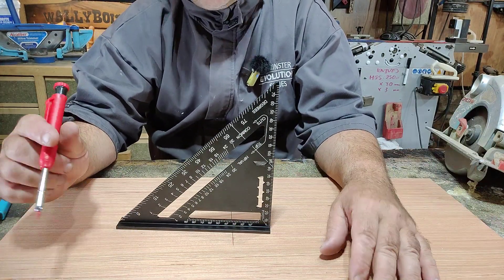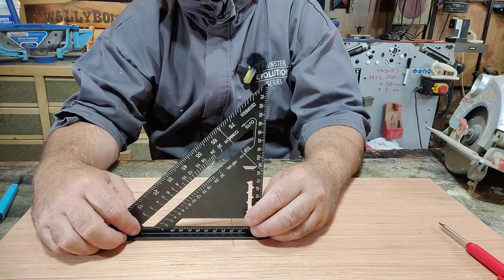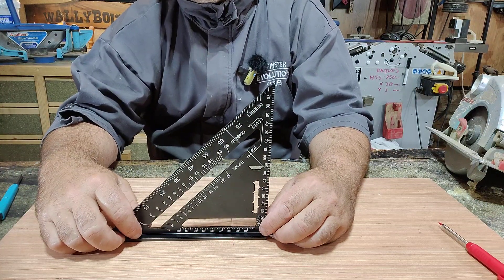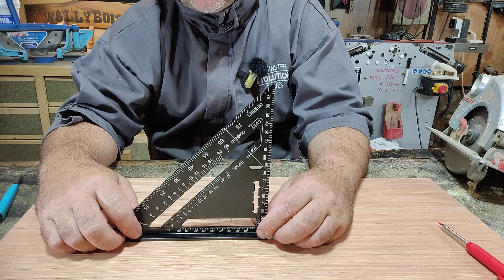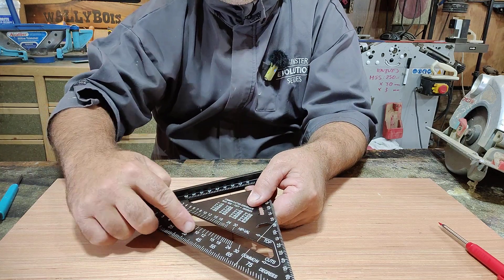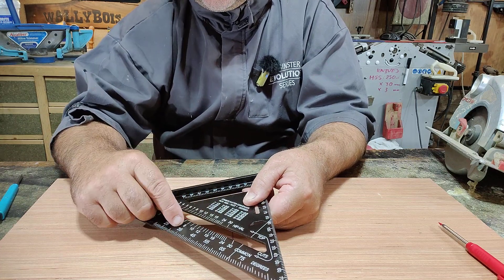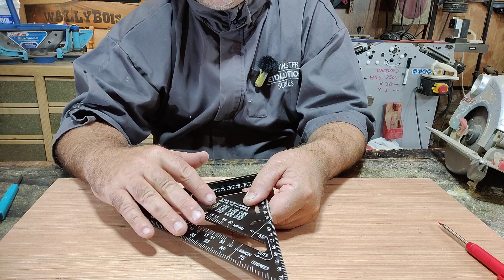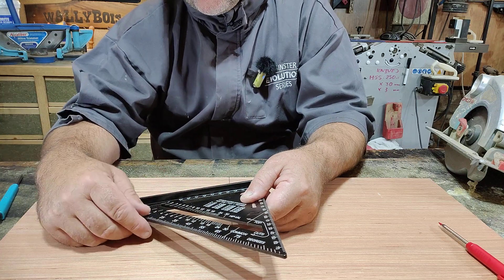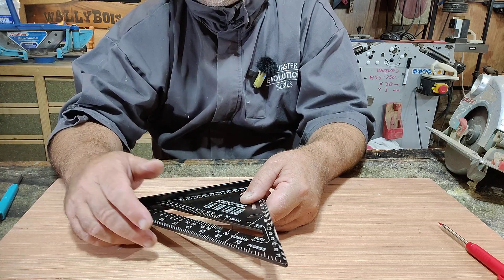What else can you do with these things? Well, there's a few things. Obviously you can do all your markings for cutting a roof — because you can find your angles. There are calculations you can do using the section in the middle here for your common cuts or hip and valley cuts. You can use either scale. I'm going to do another video on actually doing rafter cuts — whether you're doing bird mouths in the end of your rafters or doing hips or valleys.